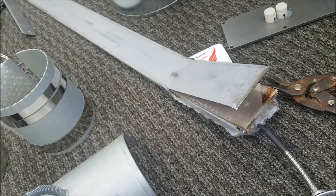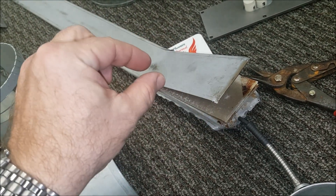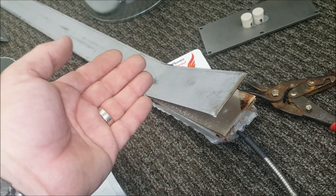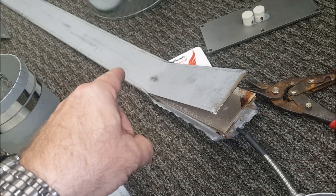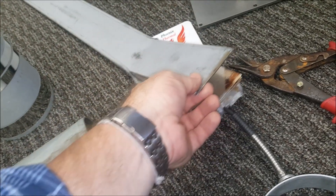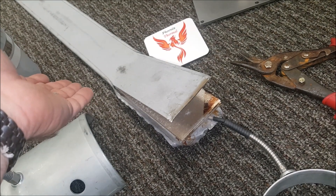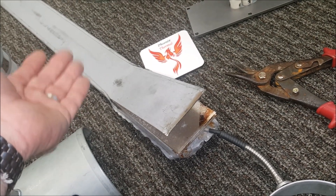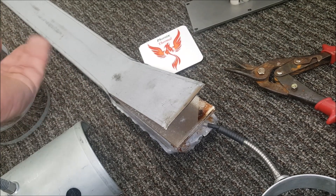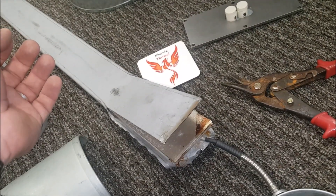With this heater that was shipped back to us, we opened it up, took a look at it, and found the heater was actually an inferior product, failing due to how it was made by the manufacturer — made outside the United States, not with excellent quality. We were able to provide a solution by taking the base metal, folding it over, putting a butt fold on the top, allowing it to be properly clamped with installation instructions. The customer is now enjoying a heater that is not burning out — where he was buying 10 per month, he's buying none now.